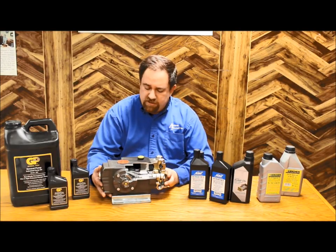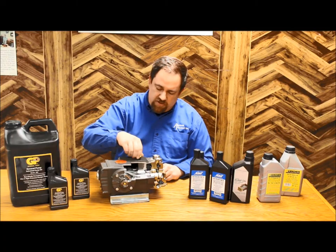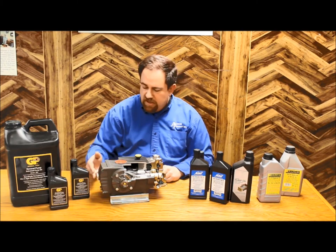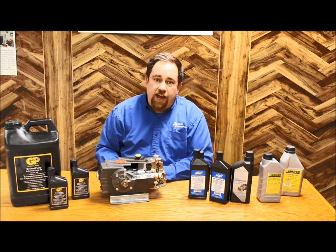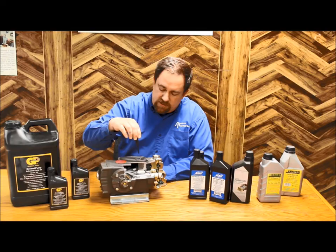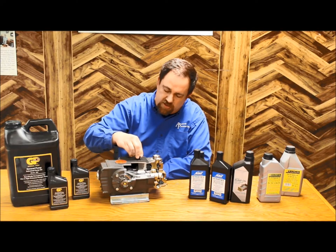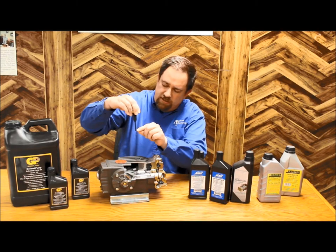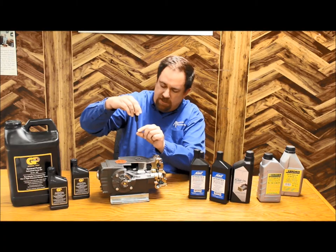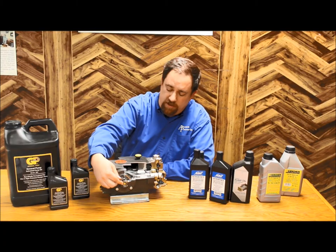One pump I've got here is a General pump, and it's one of the common pumps out on the market. I've got a dipstick. One question I often get is, do I use the dipstick to check the oil? Do I look at the sight gauge on the side or the back of the pump? I think the sight glass is the best way because it's easiest to see. The dipstick is also easy — wipe it off, put it back in, don't thread it in, just dip it, and then look. You want to see a little drop of oil right there on the bottom of that dipstick, indicating there's oil in the pump to that level.